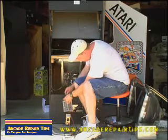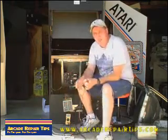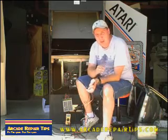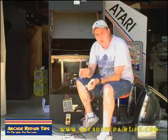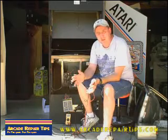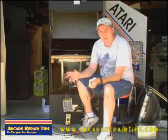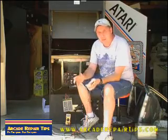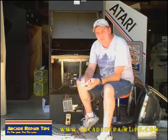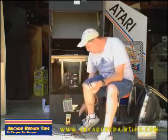Then I'm going to check the 12 volts — 11.41. Ideally you want to get as close to 5.00 and as close to 12 as possible. I have mine turned all the way down, I'm still running 5.23, and my 12 volts is only 11.4. Those are probably acceptable ranges, but we can get a lot closer than that. So maybe it's about time to replace this power supply.